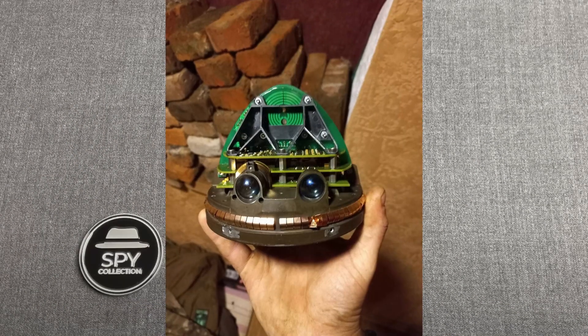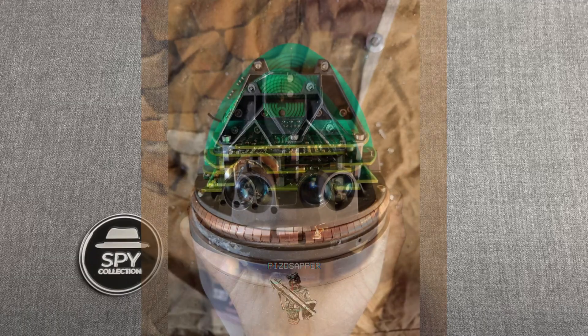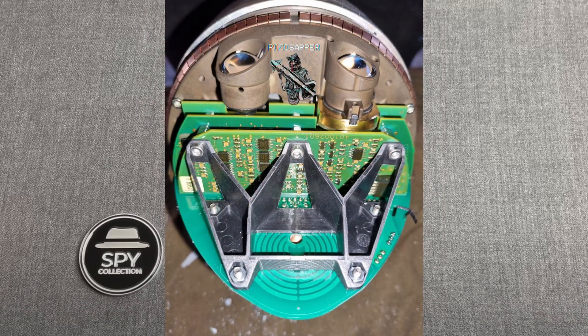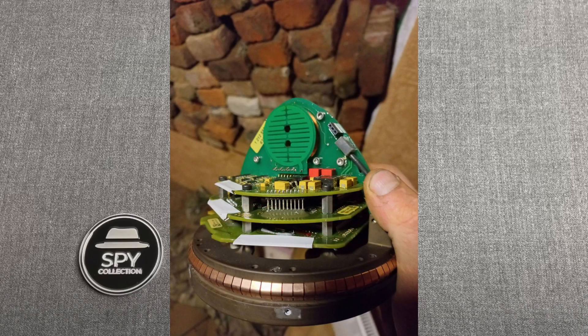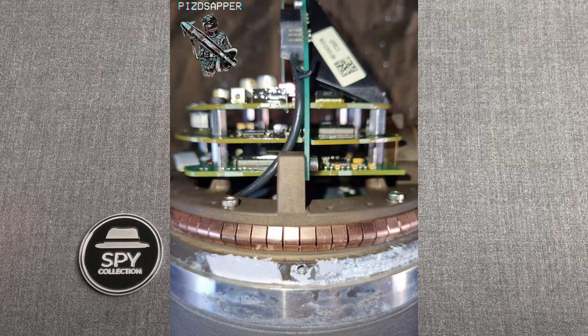And here is a stripped-down view. N-LAW is a fire-and-forget system that is using a combination of magnetic and optical sensors to identify the distance of detonation. So those are the optical sensors of that system. The other part is clearer from the side view — this that looks like a large coil is the magnetic sensor of its detonation system. So this is what's configured when the operator is setting the OTA, DA, and distance levers — this system comes with some pre-programmed modes of operation which change when the magnetic sensor will start working, and those levers select which program to run.